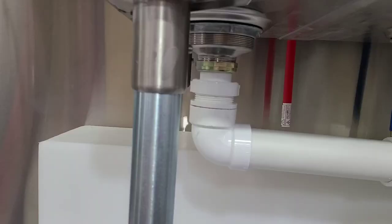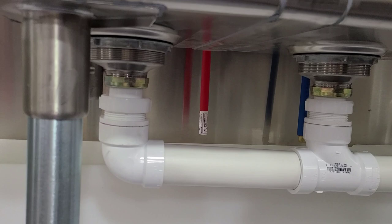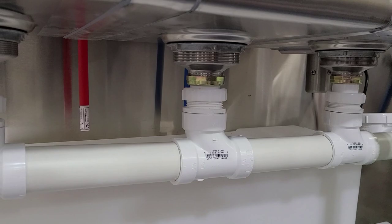You can see the two lines — the blue one and the red one. We're going to cut right here and then 90 this way with an elbow. The blue feeds over into the water pump, and the red goes straight to the water heater — not the water pump. So we don't struggle to crimp in tight spaces, we're going to take these off where we temporarily placed them and add a piece long enough to get out of this hole so we can work comfortably out here.